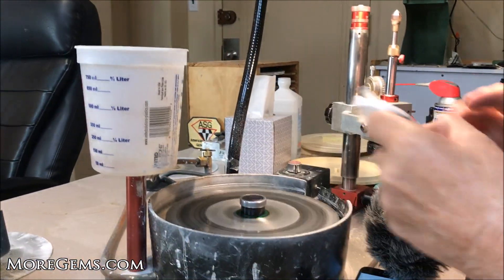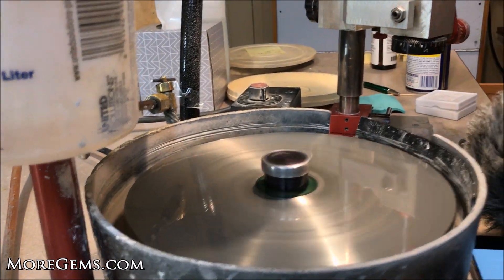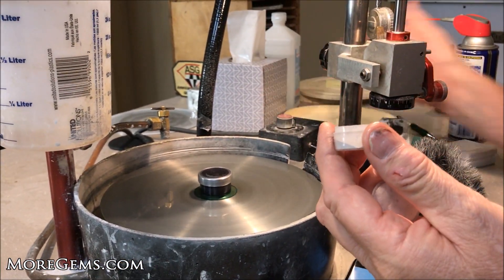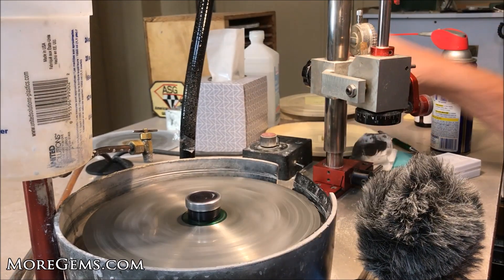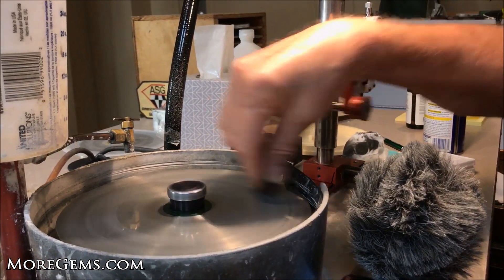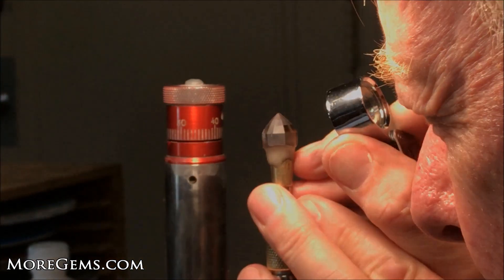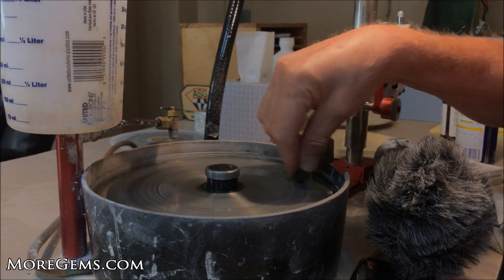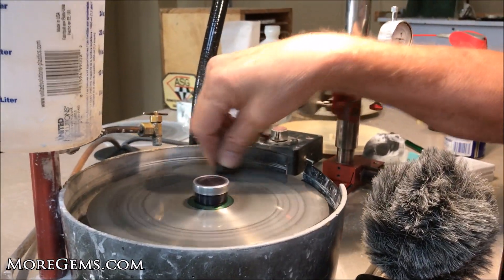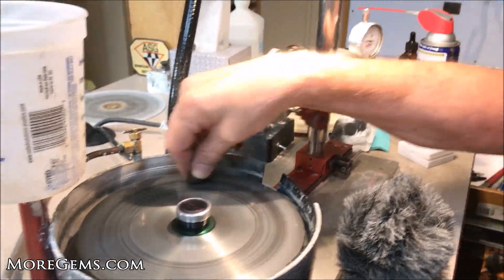As black as this is getting, it's probably time to clean off. Just slow it down a little bit so it doesn't throw everything off, then speed it back up. You'll find you'll be polishing much quicker now. If it seems awfully slow, try going to the other side — you're actually reversing the direction that the lap is going into the stone, and it can change the polishing speed significantly.